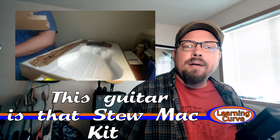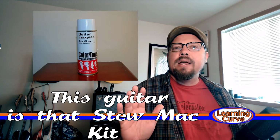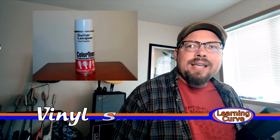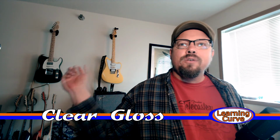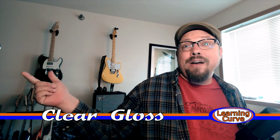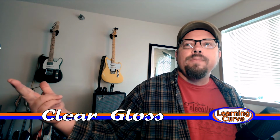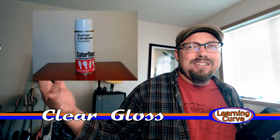The other place I learned about guitar finish from was a kit that I bought from StewMac, and they sent me 4 cans of clear lacquer, a can of vinyl sealer, and a can of colored lacquer or paint. This can of vinyl sealer has done that yellow guitar. It did the green guitar the first time when it was blonde. We're going to find out that the first time I did metal flake didn't work, so it did vinyl sealer on that coat, stripped everything off. Third guitar with that can of vinyl sealer, and I think I could still get 2 or 3 more guitars out of it.